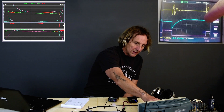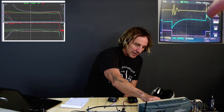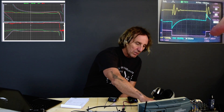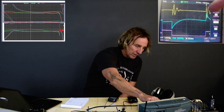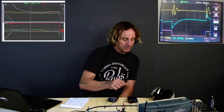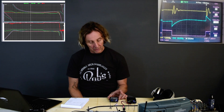We can tell if we're in polarity by the very first thing — the leading edge of the blue is going down, and we can see it goes down first then comes up. The very leading edge should follow the same thing as the square wave, which should follow the same thing as what's sent into the unit. So we've got the square wave with the leading edge up, a sawtooth-ish thing coming out of the mixing board with the leading edge up, and the belt pack. Driving it harder — we're getting into the yellow lights on the transmitter. The actual output level achievable, the sheer volume of the Shure pack, is considerably louder than the Lectrosonics. So if you actually need more volume, that could be helpful.